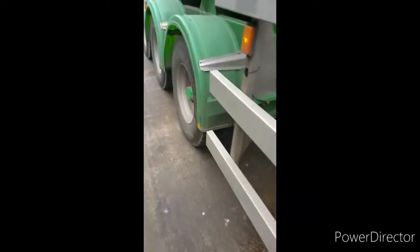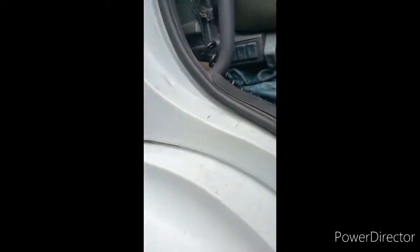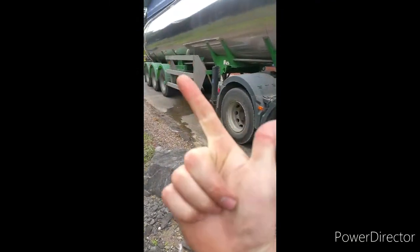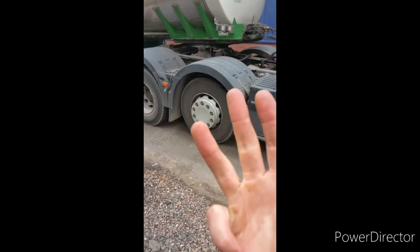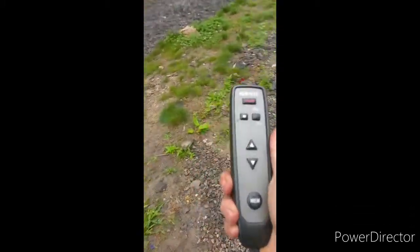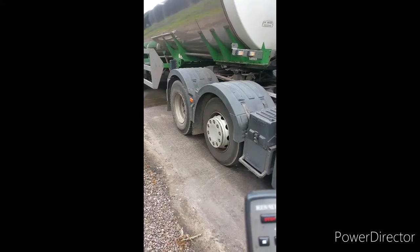I've gotten her hooked up. The last thing to do, always, is your park brake — just keeps you safe. Off she goes — done. Now before I get back into the cab, I always stand at the cab door, put my gloves back where they should be, and then I always have a quick check. Stand back and go through it: dog clip done, number plates on, legs are up, Susies are on, and last but not least my park brake has been taken off. I'm happy with that. Back into the cab — grab the switch to level out the suspension. And that'll level down. You'll see her leveling off.